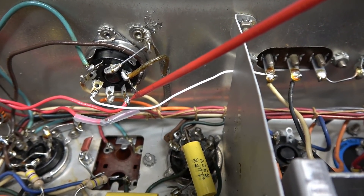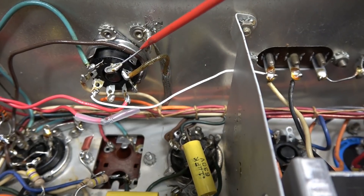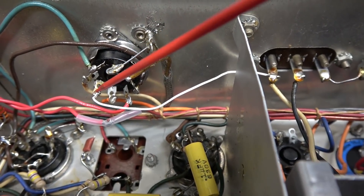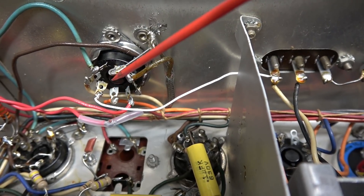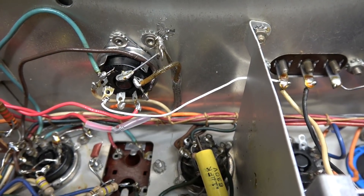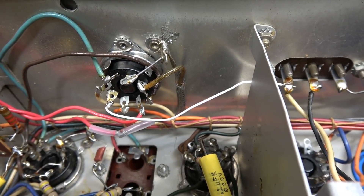The B-plus is being switched on pin 8. This ground runner that goes to pin 5 used to continue over to pin 2 — you're simply going to snip that off, and that's it. After that, this calibrator will work like it was meant to be in this receiver.